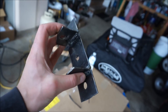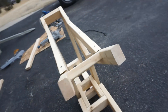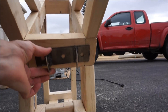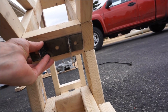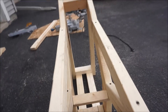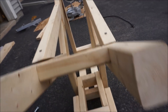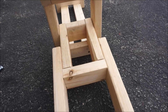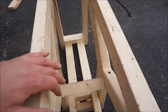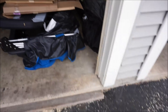This piece is probably like a quarter to an eighth inch, and you can see the welds went all the way through, so that's good. I welded both sides and that's what it's going to do — that's going to go right here and then the shocks are going to go down. I'm going to drill some holes and bolt this to the wood. I might put another piece of wood right here because this is going to have a lot of compression when the shocks compress — this piece will be under tons of load, so I'm going to double it up and bolt it down between two pieces of wood.